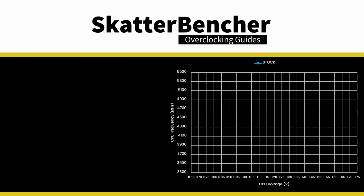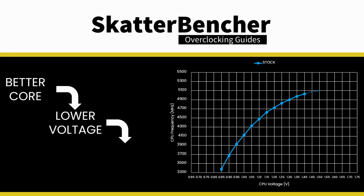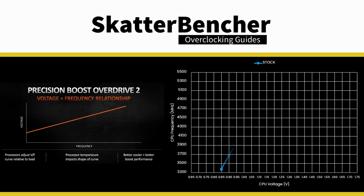The long story short is that we use reference clock overclocking and voltage offsets to manually change the voltage frequency curve. The voltage frequency curve, or VF curve, is a line that describes the relationship between the operating frequency and the voltage required to run stably at that frequency. Every core in your AMD Ryzen CPU has a VF curve. Better cores, which require less voltage for a given frequency, will be able to boost to higher frequencies given a certain voltage. Precision Boost technology uses this VF curve information to dynamically increase the CPU operating frequency.